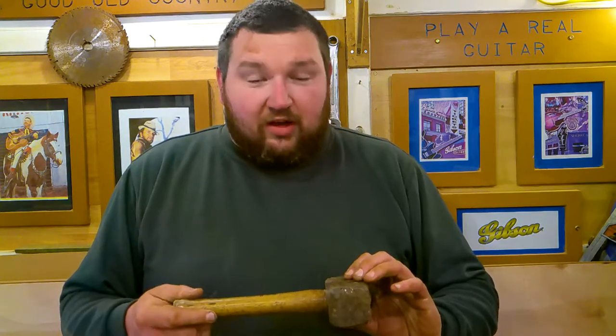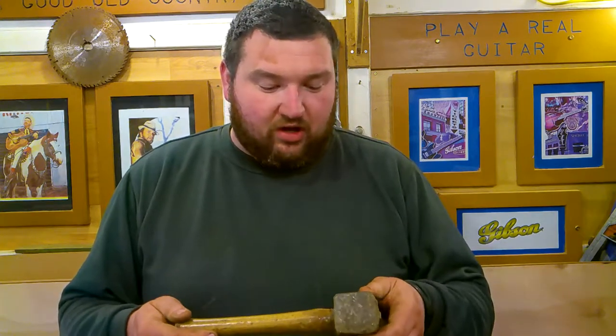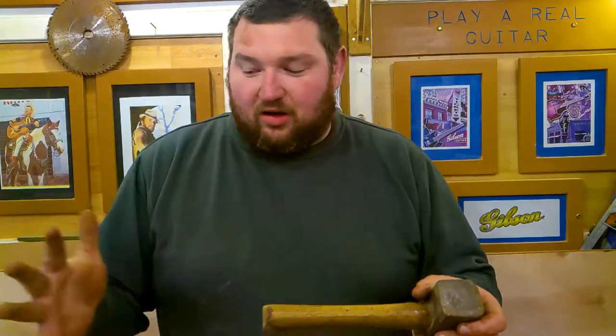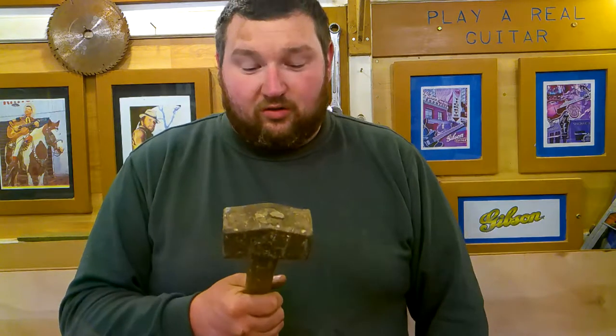A decent claw hammer is okay for demolition, again, as we've said, but if you're going to be doing a lot of heavy hitting with it, then it is better to have a club hammer, because you don't want to be putting all the force on a smaller hammer all the time. So as I say, these are normally between about 3.5 to 4.5 pounds. You do get bigger ones, you get ones with longer handles as well. Obviously, if you had a much longer handle, you'd be getting onto something like a sledgehammer. But these are good hammers in themselves.